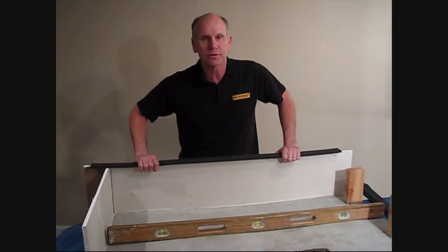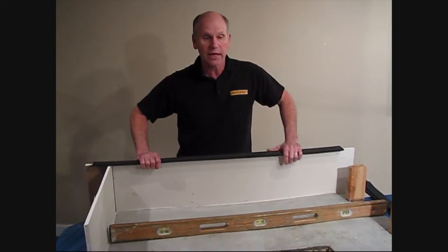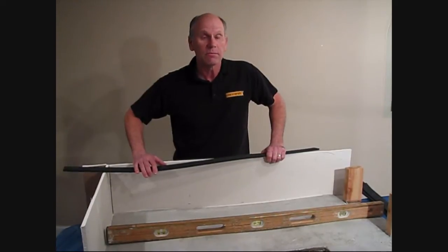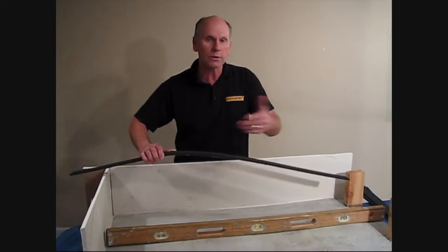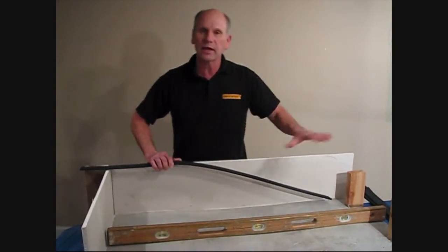Many of you have checked in with our EdStripKits.com or maybe checked on our EdStripKits YouTube channel, and you see we use our new product when we install floor heating systems. Most of those floor heating systems are done on flat plywood floors. We just do the perimeter with our EdStripKits, put our floor heat system in there, pour our self-leveler, and we've got a nice flat floor.